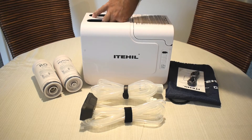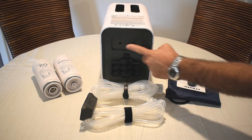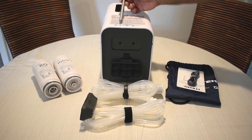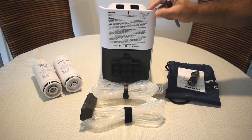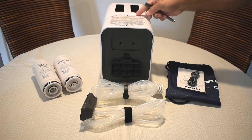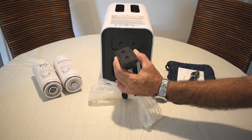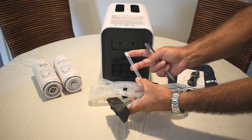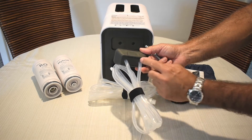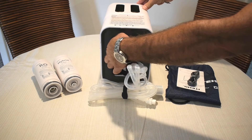Let me turn this around and show you the other side. There are two openings: the opening on the left is in line with the hybrid filter, and you're going to be getting wastewater out of that opening. The right side is RO, so you're going to be getting your purified water out of that opening. It's got two little tabs — make sure the white one is your reverse osmosis output on the right, and just clip it on. Squeeze to release.